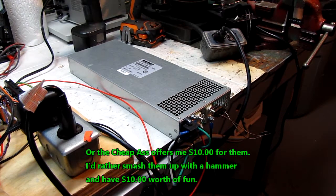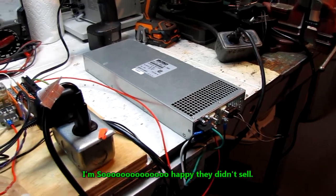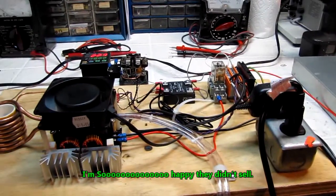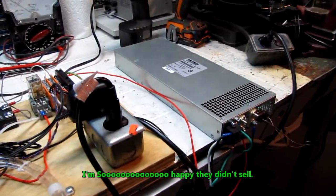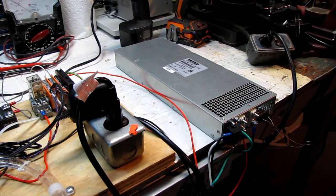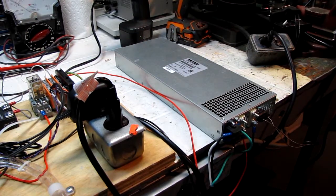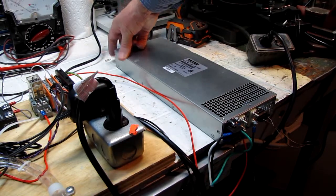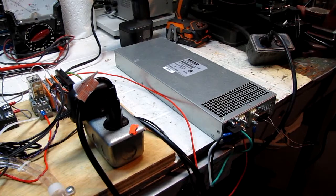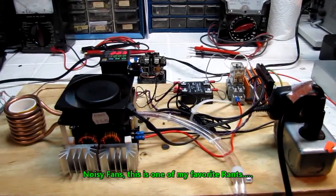The other night lying in bed I realized these are still up in the barn. I don't need that great big analog power supply — this will give me 48 volts, the nominal voltage for the induction heater, more than handle the current, and at a tenth the weight. I did have to modify it though: it's got two fans in the back and it sounded like an F-111 on full afterburner. So I put the fans in series, which cut the noise level down considerably. Now it has an alarm flashing because it doesn't see both fans connected, but the unit still works and stays ice cold with half-speed fans.